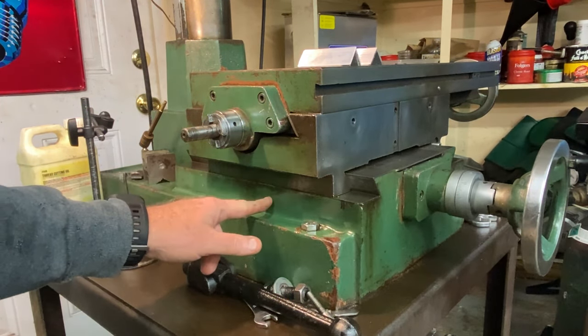I had to skip way ahead due to time constraints, so I'm just going to summarize the rest. We're going to concentrate on the y-axis because that's the one where you saw the last clips of drilling and tapping and so forth. Really, all you've got to do at that point is mount the scale onto that backing plate using the two screws — one on each end. They have some flexibility up and down because you need to re-indicate the scale itself. You can't just go off the backing plate; it's just good practice to indicate that in. I like to indicate the backing plate first — this is the second DRO install I've done. Then punch it up against that lip, now that it's in the proper orientation instead of being upside down, and then make finite adjustments running an indicator across the scale to make sure it's nice and true.